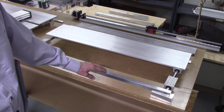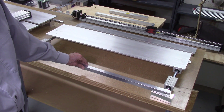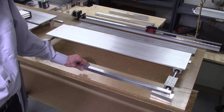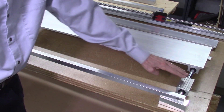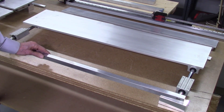The standard front bar is constructed from a 7/8-inch square aluminum bar, compared to the 5/8-inch diameter rod used in our standard AccuSlide system. This larger square bar will give additional stability to the system. All these design changes — including the larger thicker plates, the larger guide bars, the larger linear bearings, and this front bar — will contribute to a substantial improvement in the rigidity and stability of the frame for this new automated AccuSlide system.